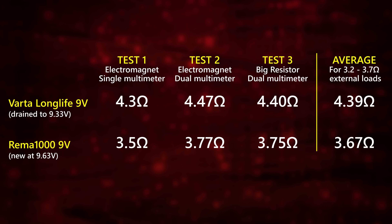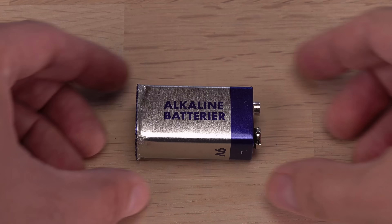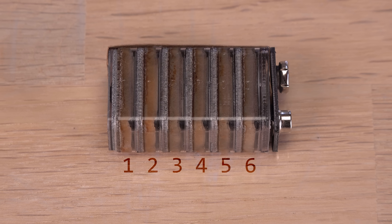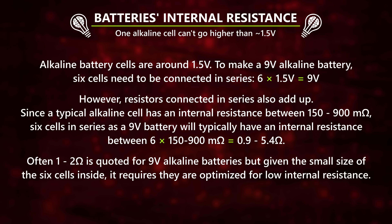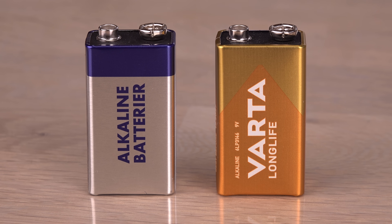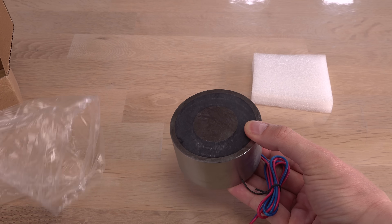This rather high internal resistance is not a fault, but what I call the curse of 9V alkaline batteries. When new and at room temperature, alkaline batteries typically have an internal resistance between 150 and 900 milliohms depending on their size. A single 9V alkaline battery actually contains six 1.5V alkaline batteries connected in series, giving a combined internal resistance of between 0.9 to 5.4 ohms for a 9V alkaline battery. That causes a significant voltage drop when trying to draw 3 amps into a 3-ohm external load — especially because these batteries are chemically formulated for low-energy devices like remote controls and smoke alarms, not for powering a 45-watt electromagnet.